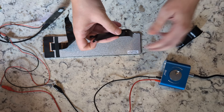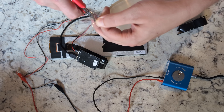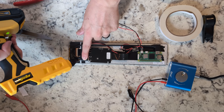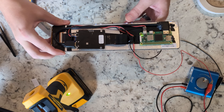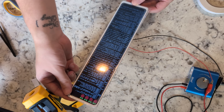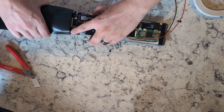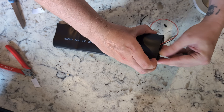I'm putting some electrical tape down on the back of the display where the Raspberry Pi is going to go. This is super important because there are a bunch of electrical connections on the back of the Pi that can short out when they make contact with a metal surface. I'm using a combination of double-sided tape and hot glue to keep everything in position. None of this would hold up to any serious force, but I don't want to couple anything too tightly in case I need to move stuff — plus I'm about to wrap all this up with heat shrink. I found this giant two-inch diameter heat shrink that is, by chance, the perfect size to fit all my components. So I'm going to stick some magnets on the corners of my display and start sliding everything in.